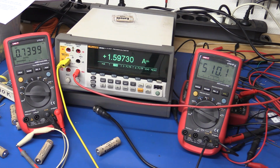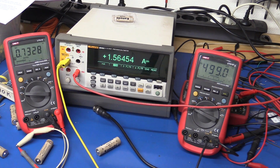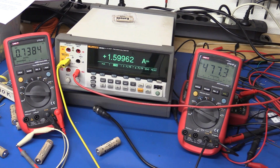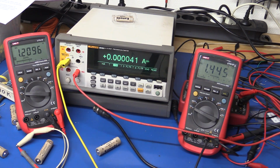So we have about 230 millivolt difference at 1.6 amps. So that's a few hundred milliwatt dissipation in this tiny chip here. And now it is getting hot. Pretty hot. I put the load at 3 amps and we're only getting 1.6, so it's basically short circuited. My battery and the wires are still fine, but the Batterizer is getting up to, I would say, maybe 50 degrees Celsius. But of course it's not a true short circuit because my load won't go any lower.